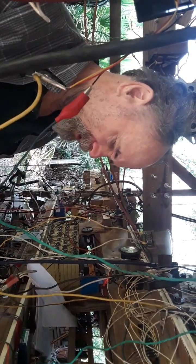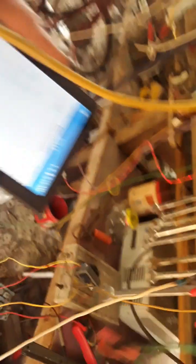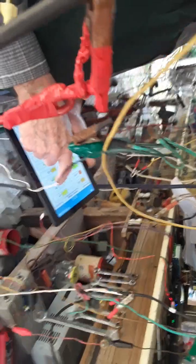In the app we can see our voltage, we can see how many amps are flowing through. We can see our charge switch — which is just transistors — and our discharge switch, same transistors. Right now it's turned off for discharging, so it's not pumping any electricity out. The reason for that is we have a couple of cells that are below three volts.